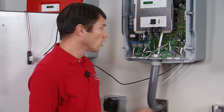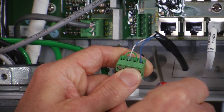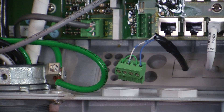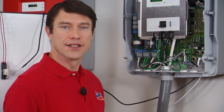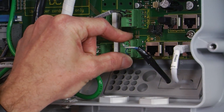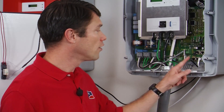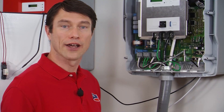To accomplish this, we're going to jumper the battery voltage negative out to the DIGIN negative and bring in the external signal wires to the battery voltage out positive and DIGIN positive. The relay wires do not have polarity, so it does not matter which wire lands on which positive terminal. With the wires inserted and tightened down in the four-pin connector plug, we're ready to install it in the Sunny Island. It will only fit in one direction. When you have the plug inserted, route the signal wires through an appropriate cable gland knockout on the bottom of the Sunny Island.